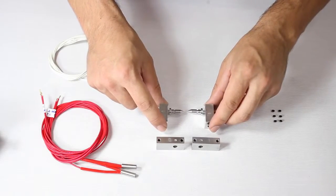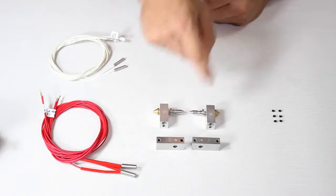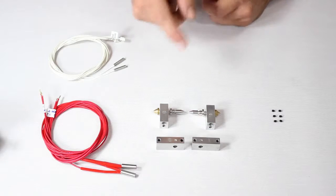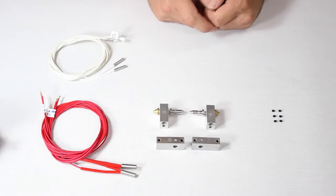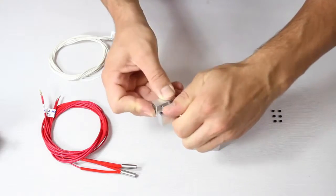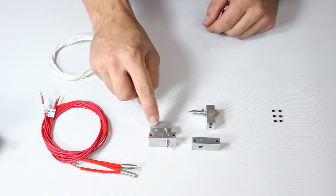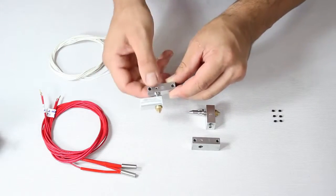And now we assemble these very important extruder components. Note that every component here has either been branded with a 0 or a 1, or has a label that the user must mark. Each of these must match up to the corresponding stepper motor. When joining the hot end and the heatsink, notice that the sides branded with a number face the same way. They mustn't end up like the way illustrated here.